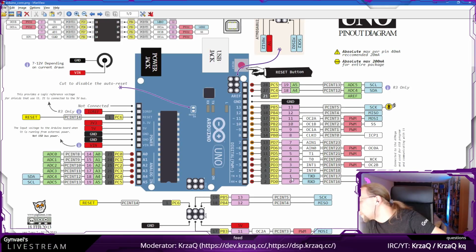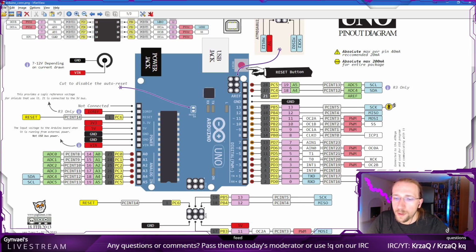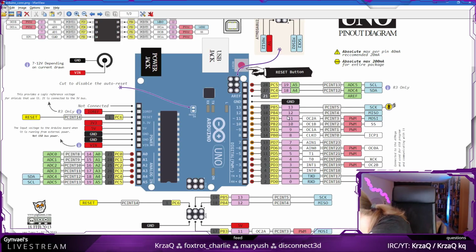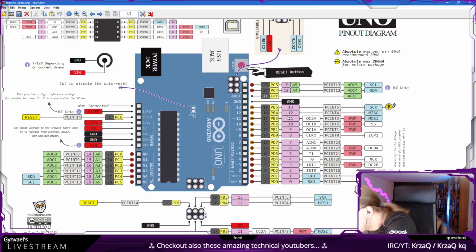To reconnect my stuff, I'm going to disconnect the Arduino. Okay, disconnected. And I'm going to move my 2 bottom pins to these locations, the MISO and MOSI, the ones which are used for SPI, I guess. So that would be 11 and 12. I didn't want to go this way, but okay. So 2 bottom, 1 bottom, and 2nd bottom are going to be moved in the same order. I hope in the same order.